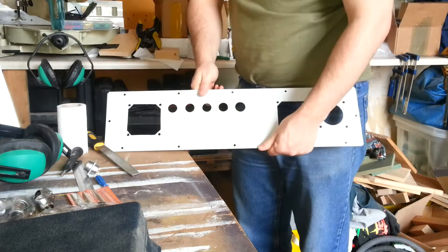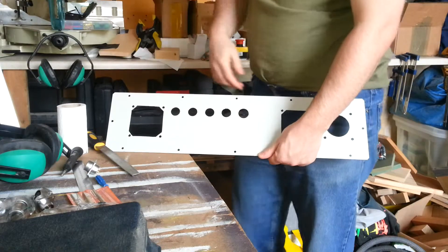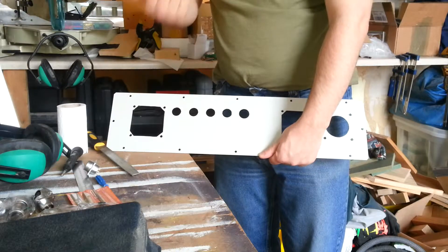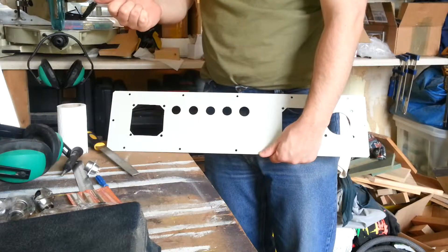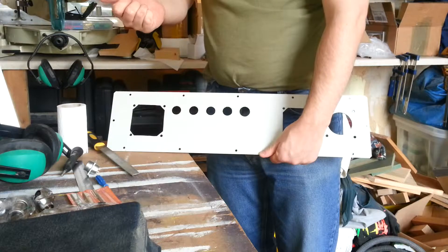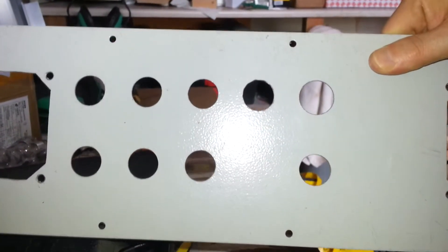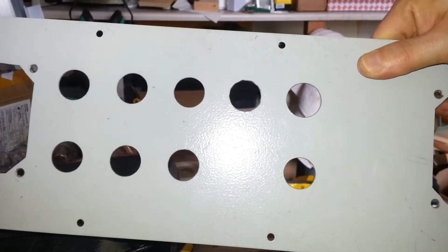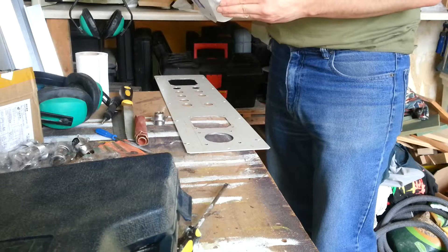So there we go — the first five holes vaguely in a line. I've looked up the circuit diagram and I need another four holes: the e-stop, the limits, the XY setup, and the spindle. So there we go, nine holes, all drilled, deburred, and ready for the mounting holes which will be 3.5mm. I'm going to clean up the construction lines now because I don't really need them anymore — most of them are rubbed away anyhow.